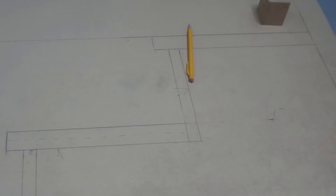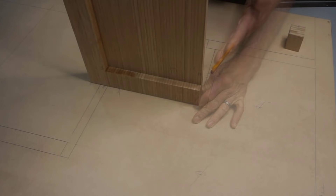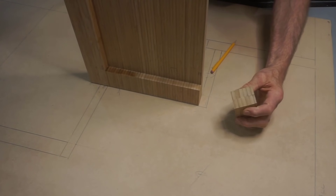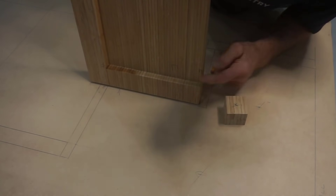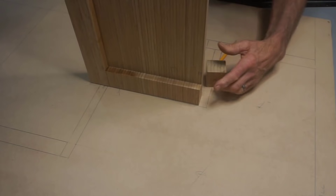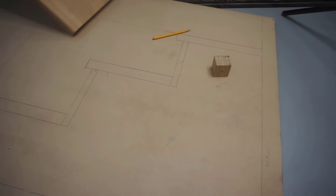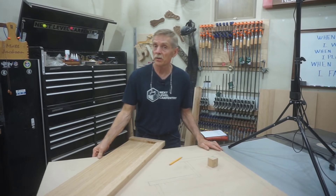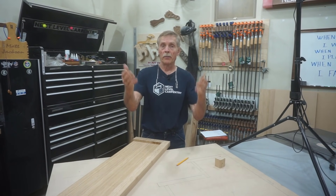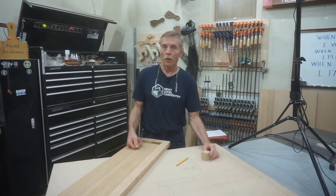Another detail visible in the plan is how I'll treat the back edges of these treads. The tread fits against the riser but sticks past the end of the stair box by an inch. I saved cut-off chunks of glued-up bamboo — lettered so each has a place — and will glue them on the back of the riser for a nice wrap-around return. I do apologize for complicating an otherwise simple set of stairs; in a perfect world I'd build a simpler example, but I'm working with the actual job at hand.